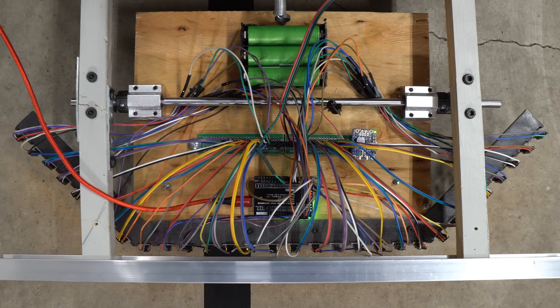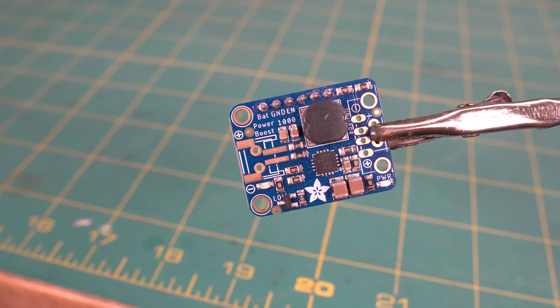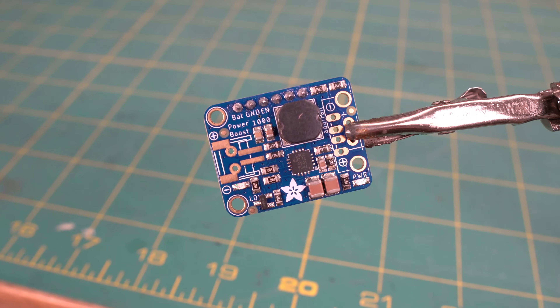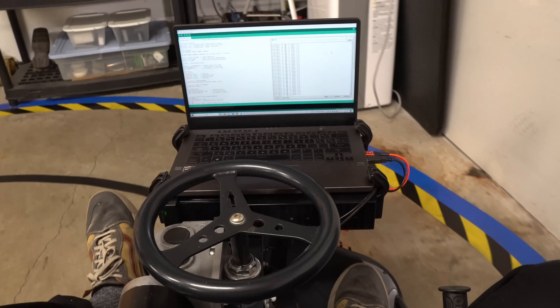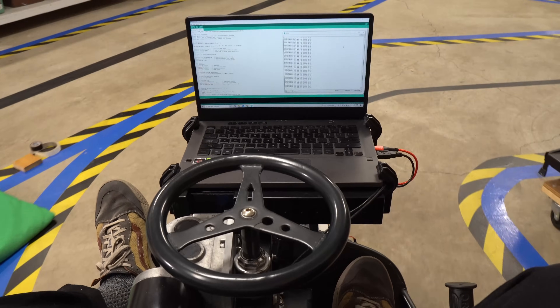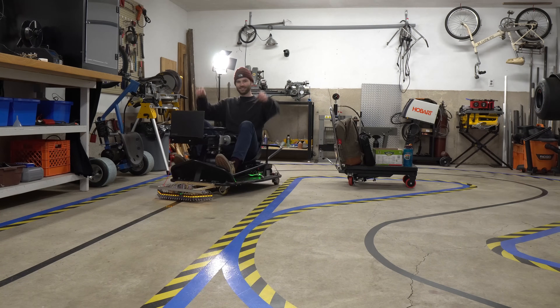Since this required a lot of input pins, I swapped out the Arduino Nano for a Mega Pro Mini. To power all the sensors, I'm using an Adafruit Power Boost 1000 with 18650 cells. The 30 sensor version was the best yet. The only downside was that adjusting the potentiometers for each sensor took more effort, but once they were properly adjusted, the performance was great.